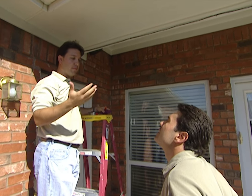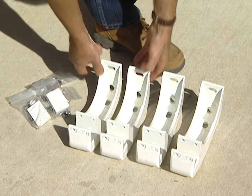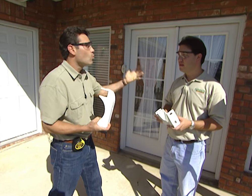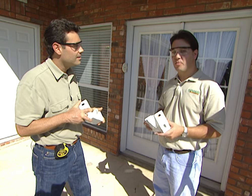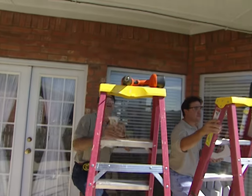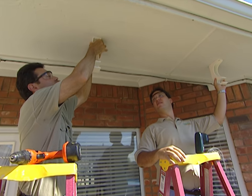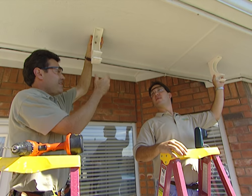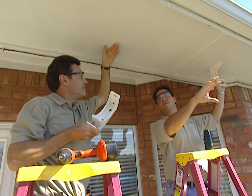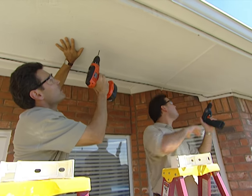Notice that measuring in on the overhang is important because when the awning is rolled up you want to protect your fabric — if we put the awning back here in the middle, the awning will be protected from the elements. These are our mounting brackets — we're going to use four for this installation; they're made of aluminum, strong stuff. The awning weighs 160 pounds, so it's very important to use at least four brackets. We've already made our marks, and we just want to evenly space the brackets out close to where the arm of the awning is going to be. Of course we have them on the studs — all we have to do is drill our holes and screw them into place.